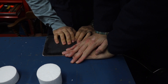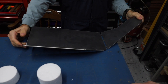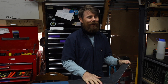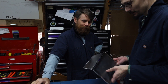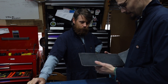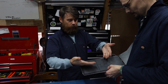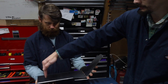That kind of looks like what we wanted. I would just like to say that having a CNC plasma table seems like a really awesome thing — think of how long this would have taken us without it. Minus the fact that you had to drive three hours away to do it and all the setup time. But now that it's set up, that would have taken us all day. All we did is take it off the machine, clean it up with a grinder, and put it on the edge of the table. One thing we learned is that these slots don't need to be so massive. We might weld in a couple spots for strength, and it's actually good to have some holes for drainage since it could hold water otherwise.